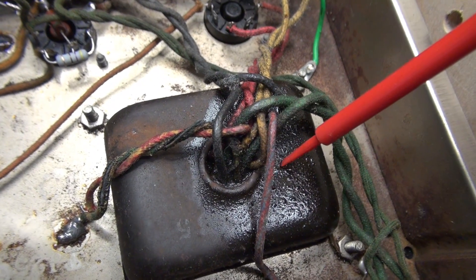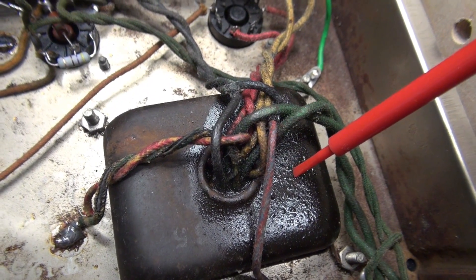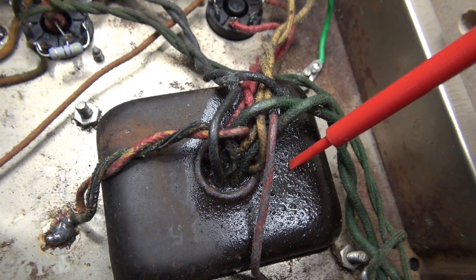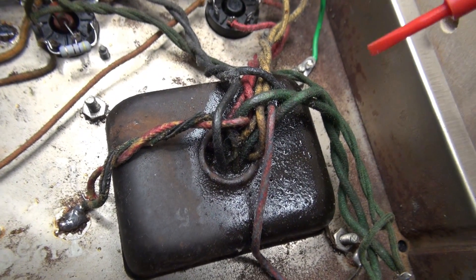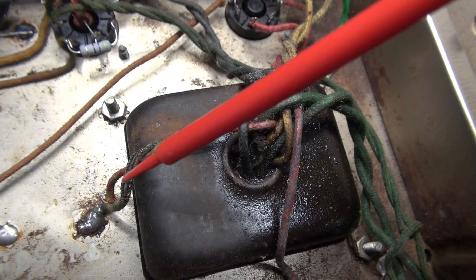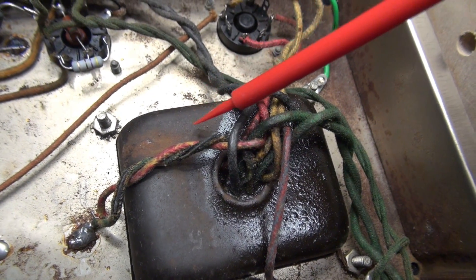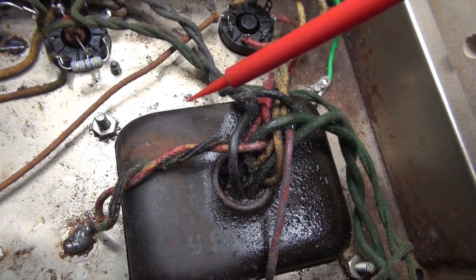As you continue over here, you'll see that the wire is actually burned in two. There's also a lot of evidence that the internal potting is seeping out of this transformer, so I believe it's been very hot. So the question of the day: what generated enough current to burn this wire and eventually fry it when the amp is still fused at the proper 2 amp rating?